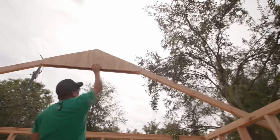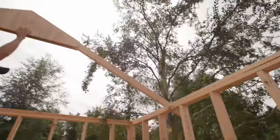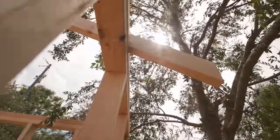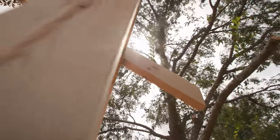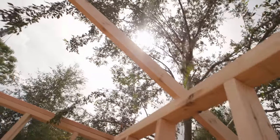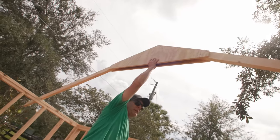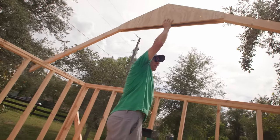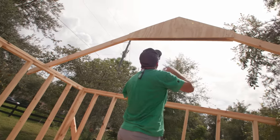That's essentially how it's gonna look, Mike. So you see how our bird's mouth sits on top of the wall? And the extension, the protrusion, that's our eave. So what I did is I just used an eight foot board, and what was left on the outside ends up being our eave. Being as this ends up being 8 feet, it's two sheets of plywood width. So it works out perfectly. So that'll balance. You can kind of get an idea what our height will be.